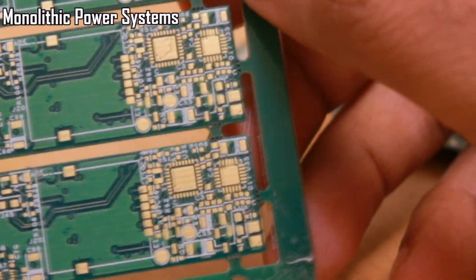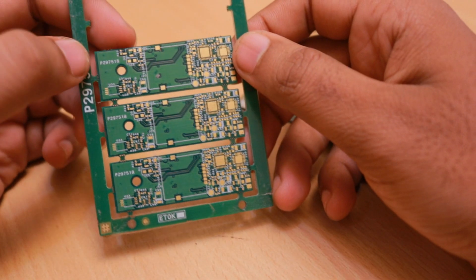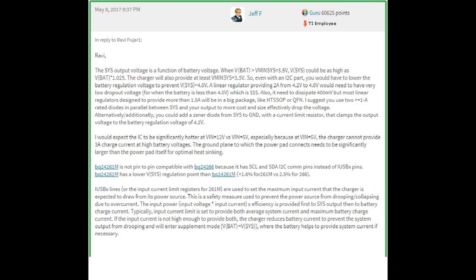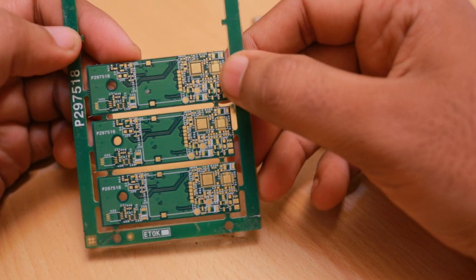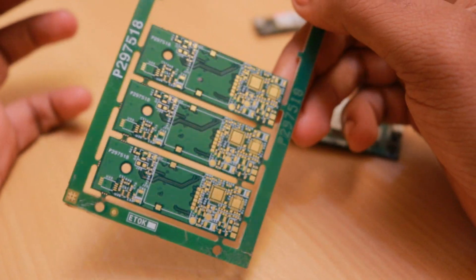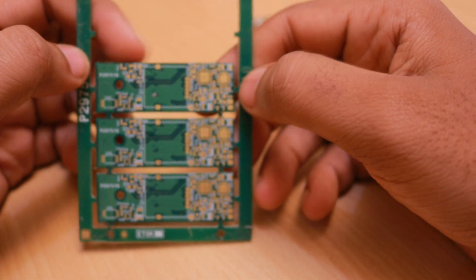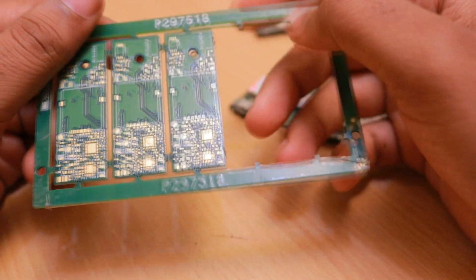That's the reason my circuit didn't work whenever the charger was connected, so I changed this part to a monolithic part and I'm getting much better results. I took this up with the TI people and asked them why this chip is giving so much voltage even though the datasheet says it's only up to 4.2 volts. We had a discussion on the E2E forum and what they said is this chip can give a certain voltage offset based on the input voltage. So suppose if the battery voltage is 4 volts, it can give anywhere up to 4.2 to 4.3 volts — it's not regulated, it has a certain offset, and it will give an unregulated output voltage even though the datasheet says it's regulated to 4.2 volts.